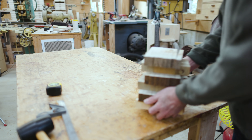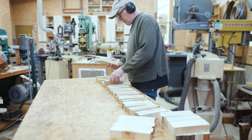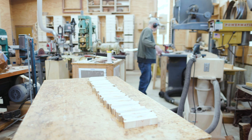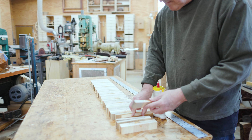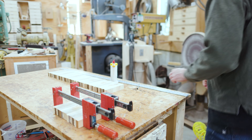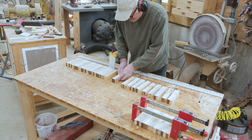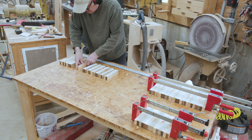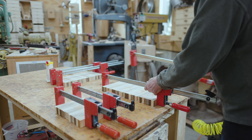In the end, that prototype sort of became a project in itself. I used a bunch of scrap pieces of pine I've been using a lot lately, and I cut those into a whole series of pieces that were exactly the same length. I could lay those out and make the first pass on trying to make a random pattern. I glued all of those pieces together — in this first pass, gluing them in pairs and then gluing the pairs together. In later glue-ups, I just glued each piece together, in sections.